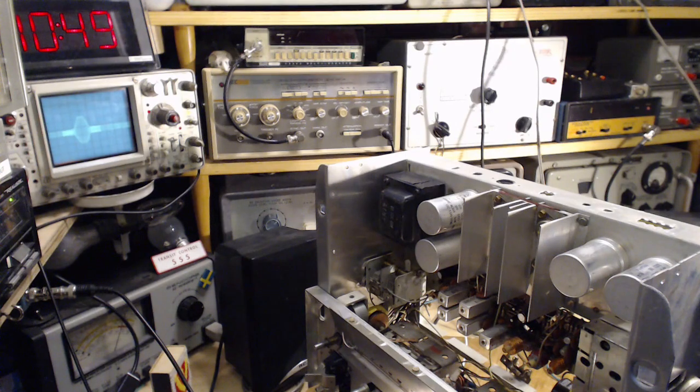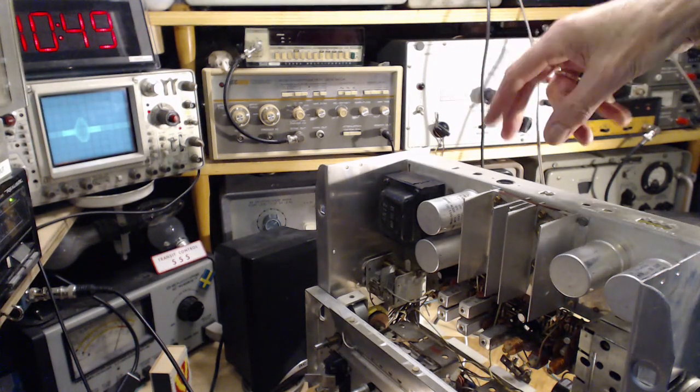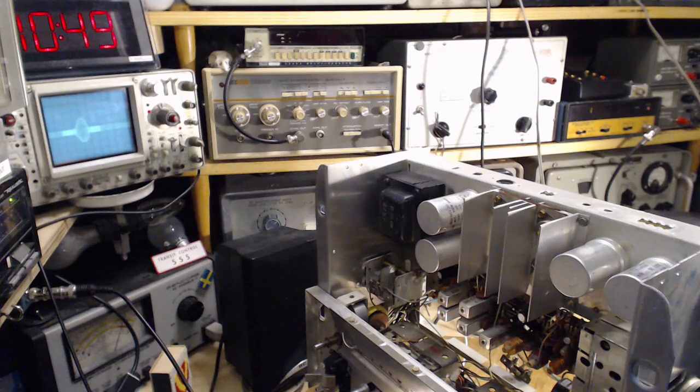Let me try and turn down the output. No, it's still flat here. Can I get it up any higher? No, only go down. One of the challenges here is I could be driving far too high of a signal into the antennas here without knowing it, and causing effects that will show up on the scope that are not supposed to be there. These are all things to wonder about now. So that was the sweep width.